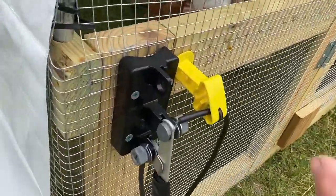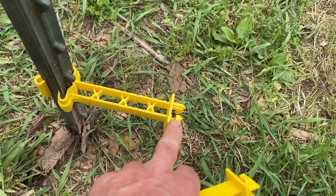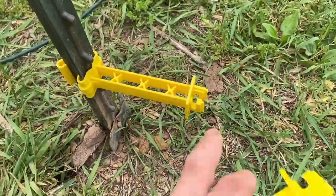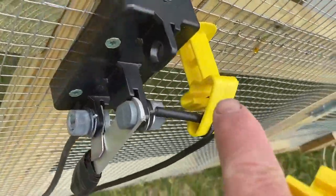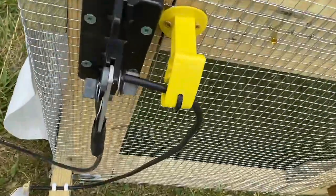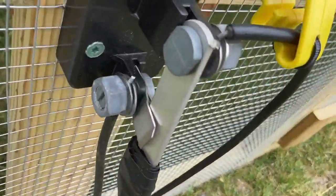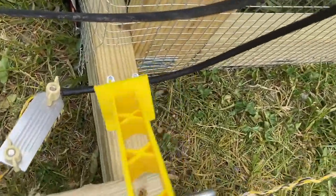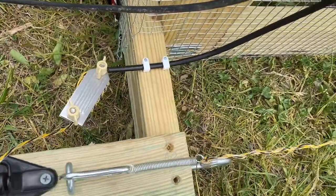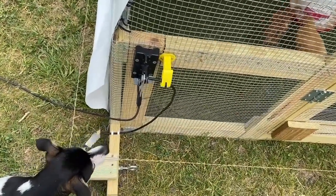One thing I didn't show you is I made a standoff here. The standoff is intended to be on a T-post with the wire running through the little zigzag. What I did is I cut that zigzag portion off and used the T portion, drilling a hole on the top and putting a wire tie through it. That way I had plenty of those and it just holds the wire so I'm not shorting anything out to the actual cage itself. Down here, the two white things are actually cable TV hangers — I had an excess of those — so that kind of holds it off.